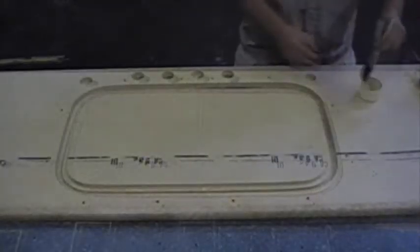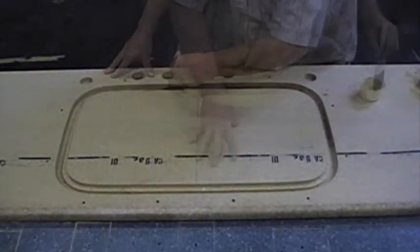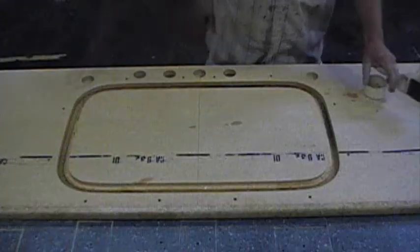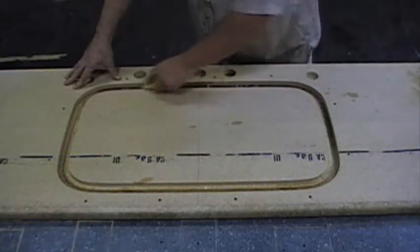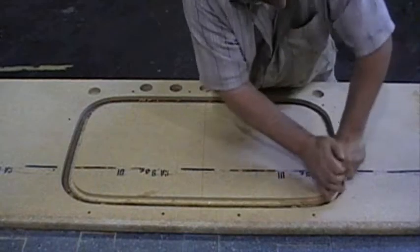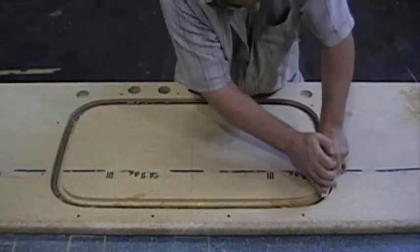Clean off residue using a 1-inch paintbrush with denatured alcohol or methyl alcohol to the base of the cutout. Do not get the outside substrate wet. Use a narrow paint scraper to clean off excess glue and residue left on the substrate, making sure not to damage the laminate.